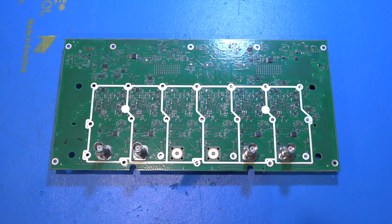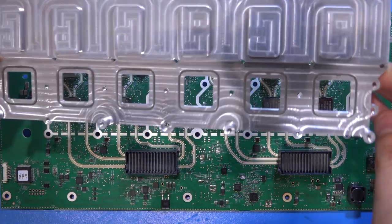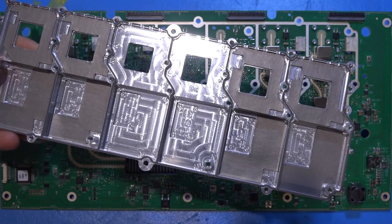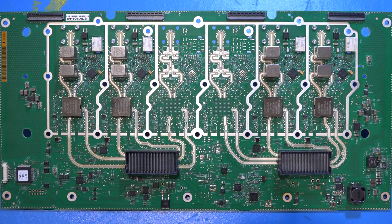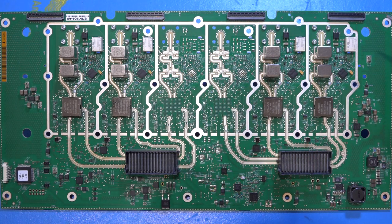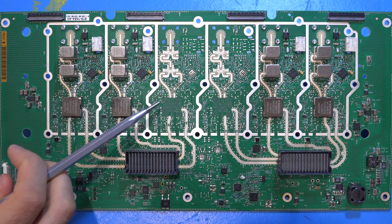Removing the top cover, we see some RF absorbers — a normal and common technique to avoid resonances and reflections built inside these cavities. Here's the board itself — it's a really beautiful mixed-signal design. We see a bunch of connectors at the top, most likely the probe connectors, with a lot of pins to probably pass digital signals too, meaning all the digital inputs would have to make it to these connectors. The ADC resources are used when the digital inputs are activated — that's the flex probe input architecture that Tektronix has come up with.